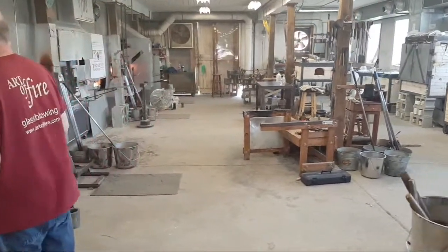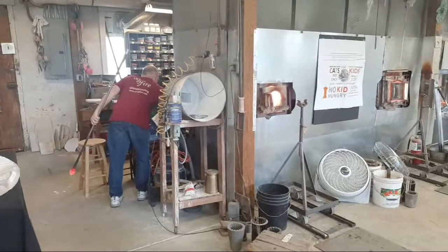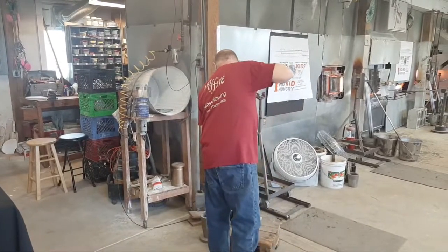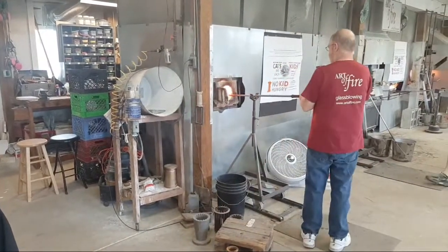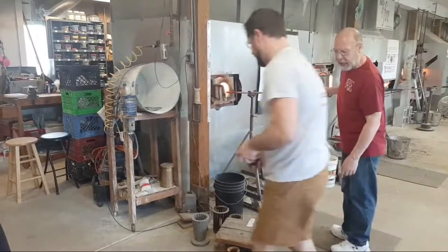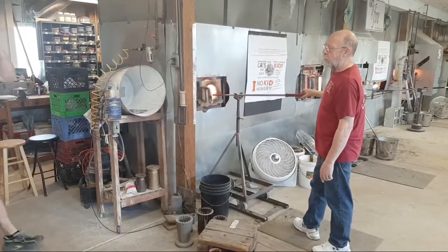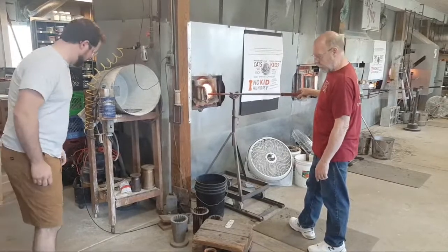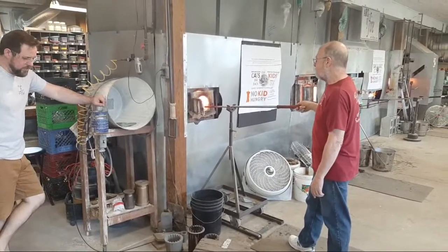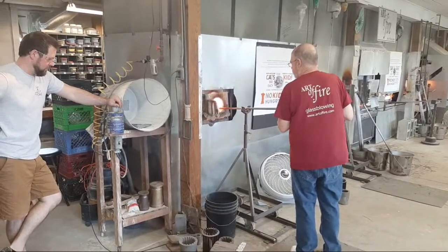If you get stuck in the mold, somebody's got to clean that baby out. You can see the diamond-shaped teeth in that mold. Those undercut sides — the part that would be underneath — actually catch the glass. So the glassblower drops the glass into the mold, blows really, really hard, throwing the glass out all around those points. Then has to suck in gently and twist the pipe a little bit in order to free it from those diamond points. That's the trick in using the diamond mold, and that is how sometimes we get stuck in them.